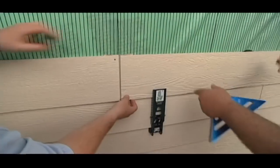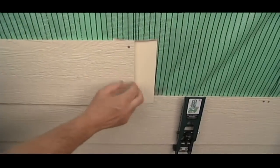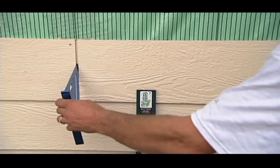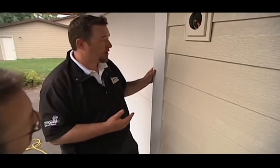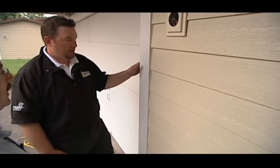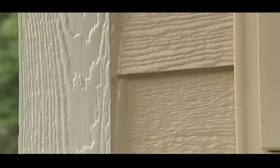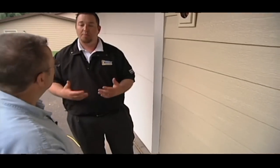A lot of companies will use just a piece of tar paper slipped in back there, but the color-matched aluminum will last forever and really make the house look nice. The final step to finish off the LP SmartSide is caulking — we use OSI Quad caulking color-matched to the diamond coat finish. When you stand back, you can't even see the caulking because of that color matching. Our installation technician did an awesome job making sure there are no bubbles and it all blends in nicely. This is something we train on regularly — it can really look bad if you don't know what you're doing, and the last thing you want to see is bubbles in the caulking.